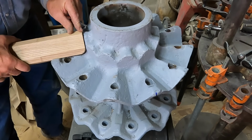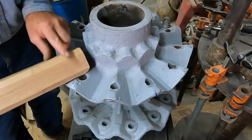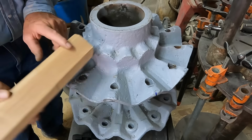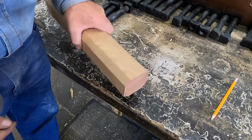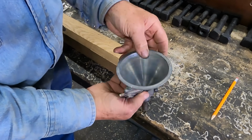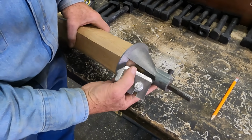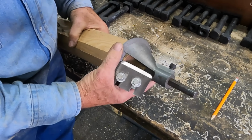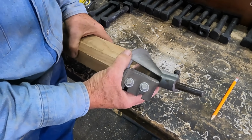Yeah, that shoulders up like it should. That round over allows for these corners. I think that's exactly what it wants. Well, on the other end is going to be where the tenon goes, and this is the largest spoke cone, sometimes called the pointer, that I have. And it's going to be right there at its maximum limit on putting the point on these spokes.